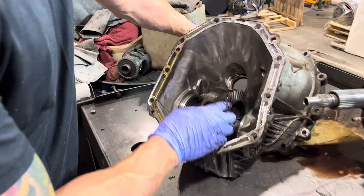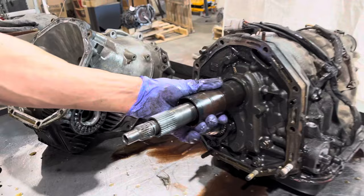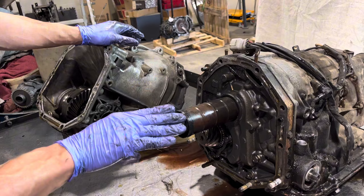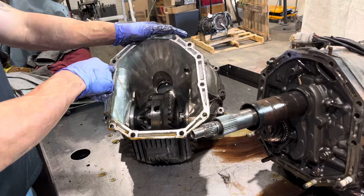These things are geared pretty steep. If you look at the pinion, it's got very few teeth — it's like something you'd stick in a Dremel. And we have this here, which is an important sleeve. It's got a seal on both ends and it keeps all your differential oil from encroaching into the transmission and the fluids mixing. We also have this seal here, which is important not to forget, because that's another seal that keeps your fluid from mixing. That vents your front seal through here and then it comes back through here and could drain into the sump, into your transmission pan.